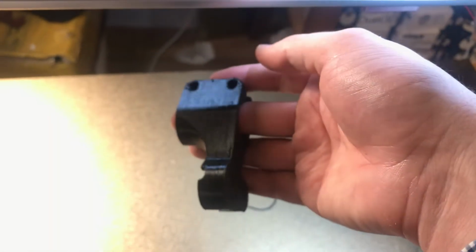The great thing is, with the dimensions of the machine, again, you can see in the bottom here the smooth PETG or PEI, polyetherimide, and literally just a tiny flex like that, and a tiny movement is all you need to free your part. So then we're going to put this back here. Just as easy as that. Slide it in there, align it. I'm doing this one-handed, so it needs a little bit more help sometimes, but that is literally all it takes. Get that, your finalized part popped off very easily to go into post-processing now.